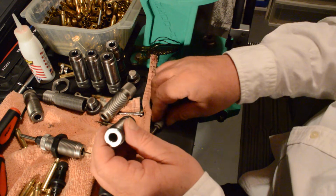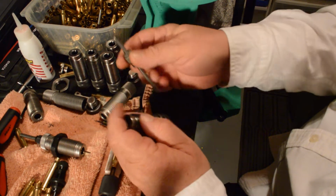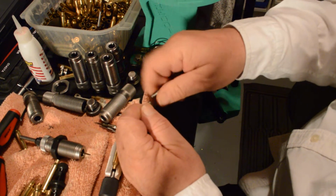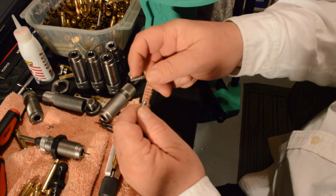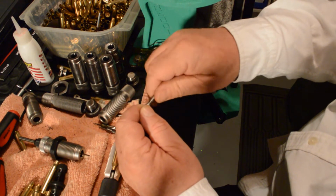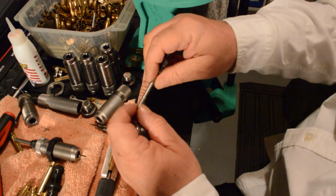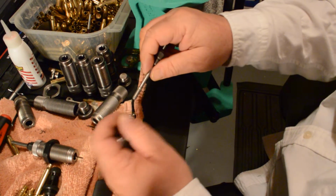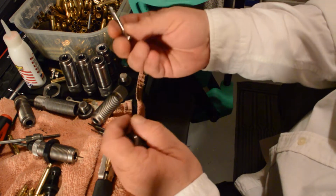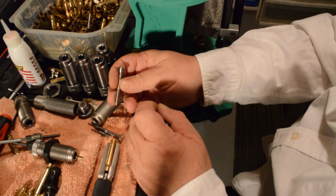Another key feature, no spindles, just threaded rod that they buy and turn a sizer onto with a pin. Cheap threads. These aren't rolled, these are actually cut. So you can actually get hung up in a case when you're expanding the neck and pull this expander right off this spindle. Okay, so now with ours, it's a drop-in, it's one piece, it's serious steel, okay?